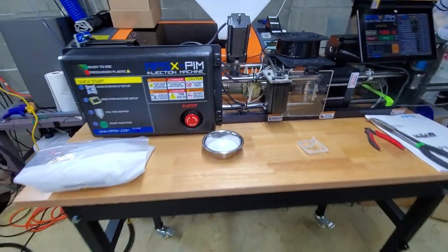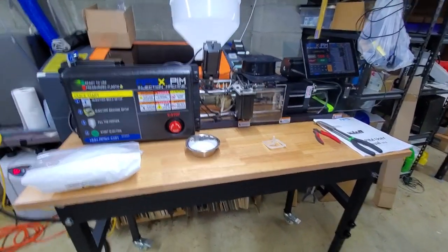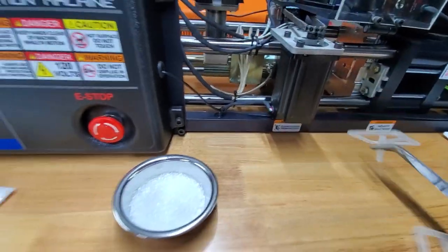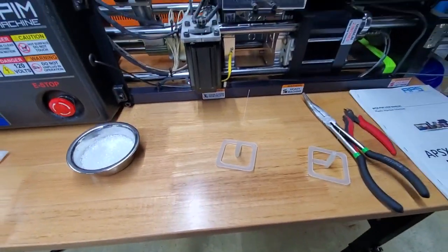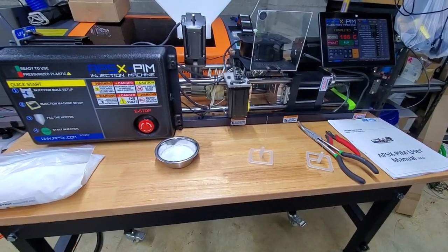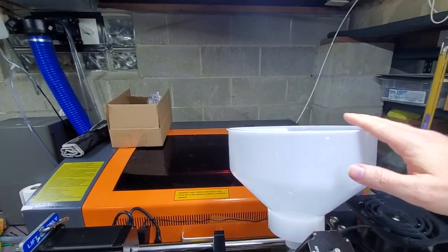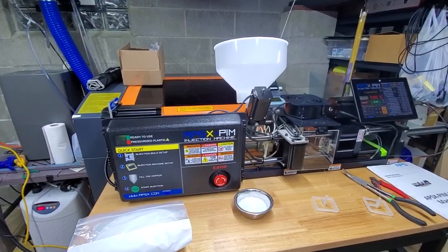A lot of things I design are 3D printed, but you can't scale that — 3D printed parts just take way too long. This machine has a cycle time of one to two minutes, and with that I'll potentially be able to make four or five hundred cases or components in an eight-hour shift. You could theoretically run this thing almost 24 hours a day. I'll have another system to feed the hopper — some plastics need to be dried and kept low-humidity, but those are all challenges I'll solve.